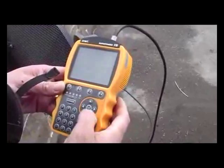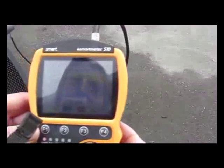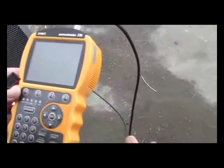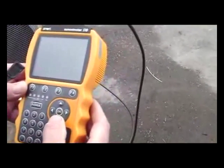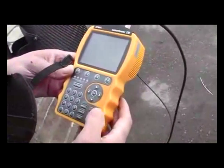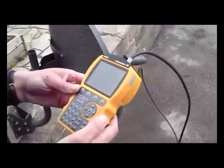You can hit the exit button to get out of here and come down to a different transponder. Going back up to transponder 1-1-2-2 to see if it's as well aligned. You can see that possibly we could tweak it slightly better for that particular transponder. Going to the transponder below, you can see it's quite well aligned. The signal levels on the middle transponder were reasonable, so it would probably be in a good position. We're reasonably confident if we bolt this in we should have no real difficulty. So that's how to use the Smart S10 meter to align a satellite dish.